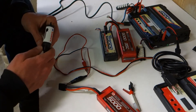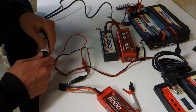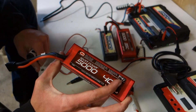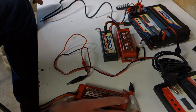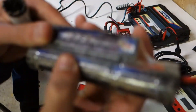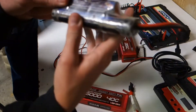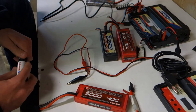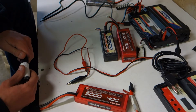That's how I've always charged mine. The voltage is different too — this LiPo is 7.4 volts, which I think is equivalent to a six-cell nickel metal hydride, and this one is 9.6 volts. The cell count on a LiPo and a nickel metal is different.